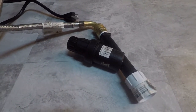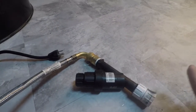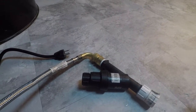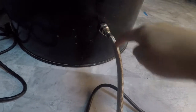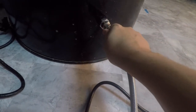I didn't want to order a $40 or $50 pressure regulator, so I went down to Home Depot. Pretty much everything on here is either sourced locally or something I already had, aside from the float valve. I wanted to do this completely on the cheap, investing everything I make back into the company. I put a braided hose on here because this area heats up dramatically — if you attach a regular hose directly, it will start to melt and cause problems from the water pressure sitting there.